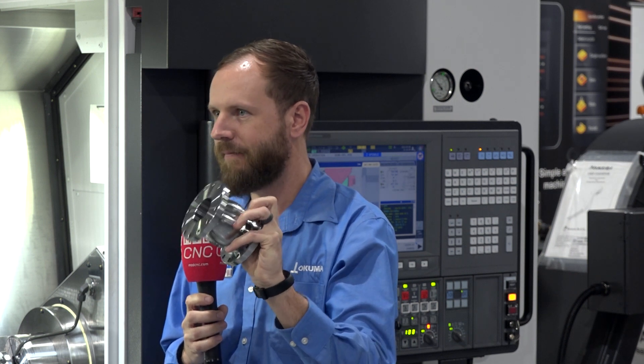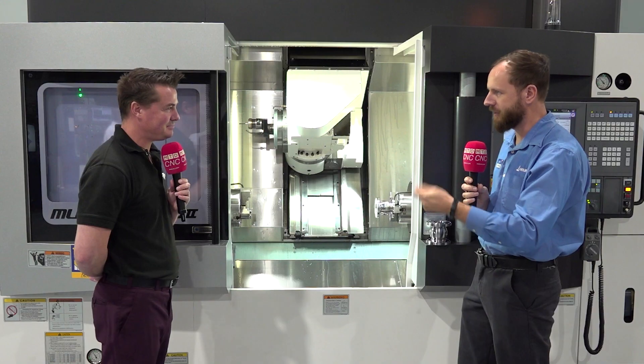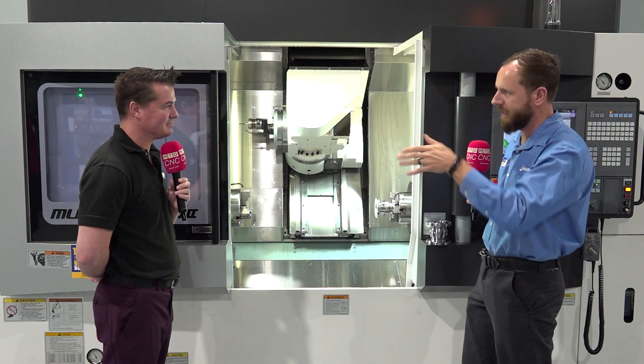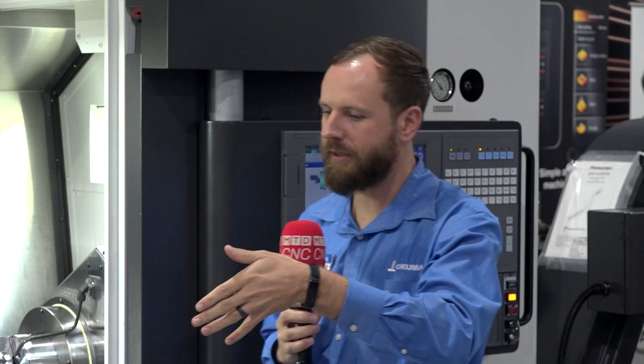This is something you'd put in a bin and you're done with it — you might need to wipe it off. It's not the kind of part where a person still has to handle every single piece. That's the flexibility you get from being able to tilt the head. Some of those features require being at an angle to reach around something — that's usually where you'd put the human in with small tools to get into crevices. Being able to rotate the milling head around lets us do that with ball end mills.